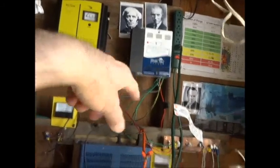I don't want to go through the bureaucracy and all the requirements to get grid-tied to my utility. And also, batteries are expensive. If I could just have 1 or 2 batteries always on, and then use the grid-tied inverters for boosting the AC circuit power to carry loads, then that would be great too. But it would just be during the sunny times. So sunny times, run that air conditioner. Sunny times, run that electric heater. Sunny times, run the water heater. Sunny times, run the pumps for pumping water into my tank or filtering the water, whatever.